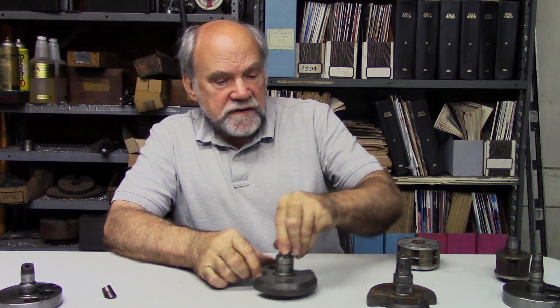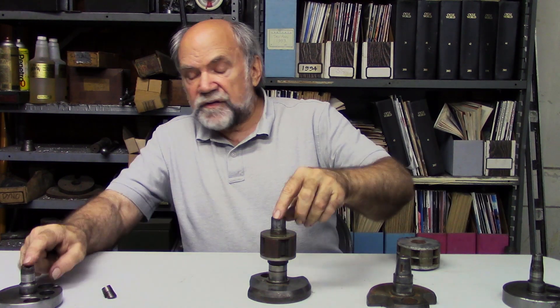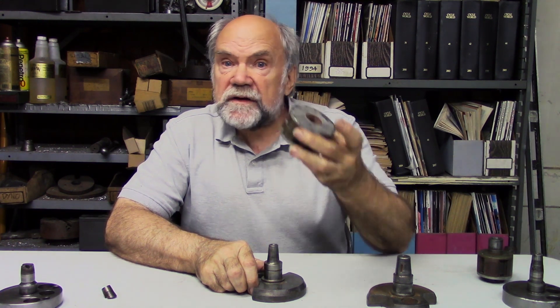This kind of thing has happened to all the manufacturers at various times. It happened to Kawasaki — this flywheel is from an H2R, and it had the same size taper. It was an industry standard. However, it wasn't up to the work once people went racing. When Kawasaki took their H1RW — W standing for water-cooled — into Grand Prix racing in 1975, they had some ignition rotors break off in just this fashion.